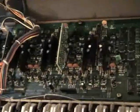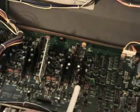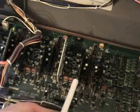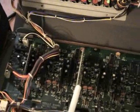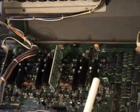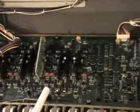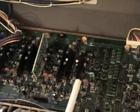Here are the chips. Let me get a pencil to point this out. The chips are on the left-hand side of the synthesizer in three groups. The voice chips are on the outside of each group — the one in the center is not a voice chip. Each voice chip is clearly printed "Roland 80017A." This board already has two replacements. Chips are numbered 1 to 6, starting from the right going left. So chip 1, 2, 3, 4, 5, and 6. In my case, chip number 1 is the one we're going to take out.